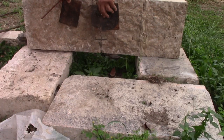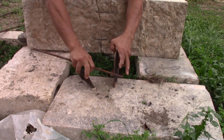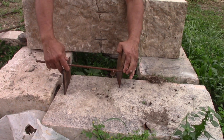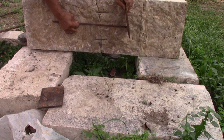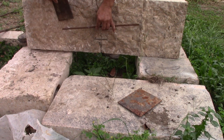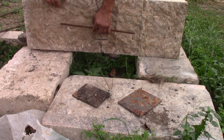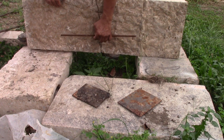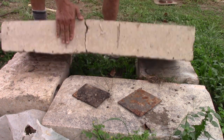These are two pieces of steel. They look like that. And you've run a threaded all-thread, a post-tension bar, through them, and tighten them on each side. That would go here, mounted here, and threaded and tensioned up. So it would be like that. Of course, it wouldn't bend over. It would be reinforced not to bend over. You'd put them here and here, and that would be externally mounting it. That would have the same effect, pretty much, except you'd be able to watch it, monitor it.